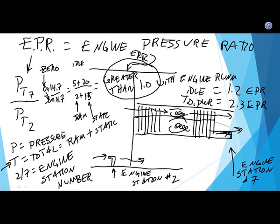Runway, and if it can't produce takeoff power, then it's going to need a longer runway than the book and the manufacturer said. And they may end up driving off the end of the runway before they get off the ground, and I don't think anybody likes that. Or the pilot will push the throttle forward, and the EPR gauge will go up, and it won't get up to the takeoff power setting that's required for that day. And the pilot will go, we'll have to abort the takeoff and taxi back, and no flying that day.